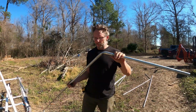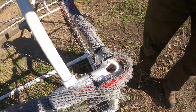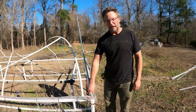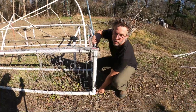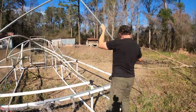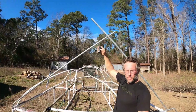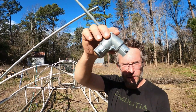After bending the pipe, I drilled a 3/4 inch hole into my frame here that the pipe will slide down into. Now we bent this at such a height that the whole pipe sits at the bottom. This will help with stability and strength. So it looks like we're gonna have to cut these so that they meet up, and I'm also using a 90-degree conduit coupler, and that's how we're gonna fasten them together.